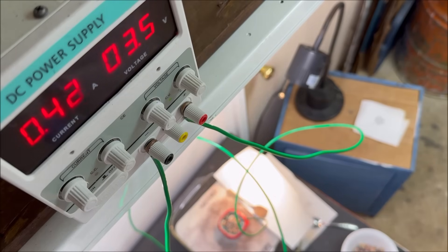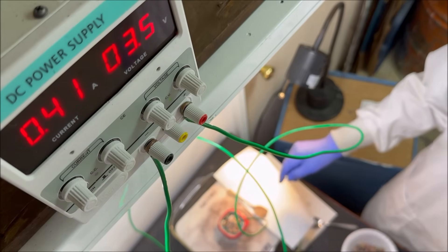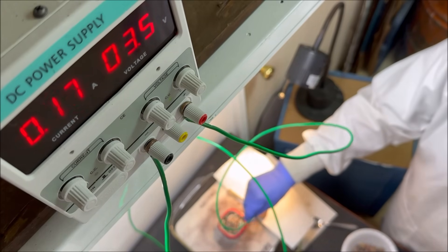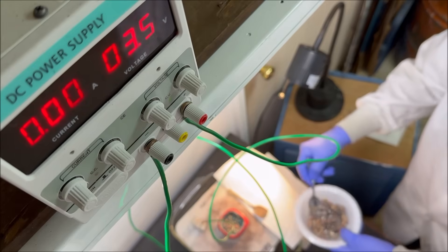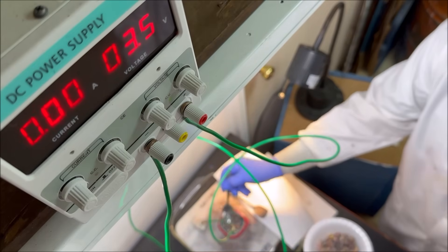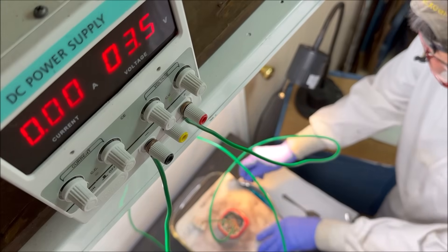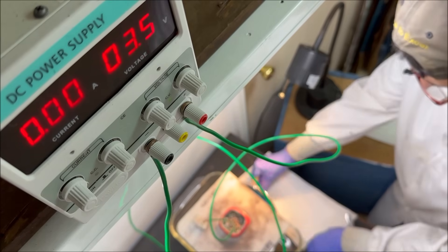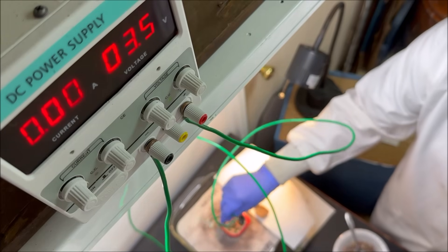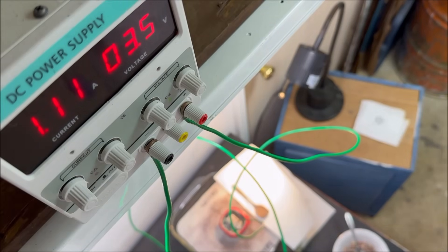Welcome back to my channel. I've got the camera adjusted so you can see the amps as I do this silver cell maintenance. I'm going to pull out the anode bar, get it up out of the way, add some more of our impure silver, then reach in and stir this up. Now we're going to reinstall the anode bar and look at how the amps jump back up — they're over one amp. That's what happens when I do this maintenance.